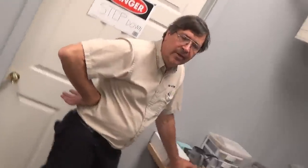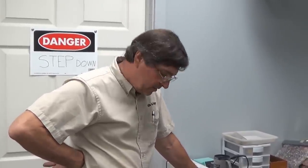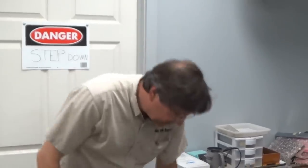Line cord. Why? The hand plug. It's usually in bad shape and it's generally an indicator of the work that's done to the rest of the machine. Although not always, but it's the first thing that you deal with when you have a machine that is electronic. It plugs into the wall, so you must pay attention to something that is actually going to be either a shock hazard or a fire hazard. It's common sense.